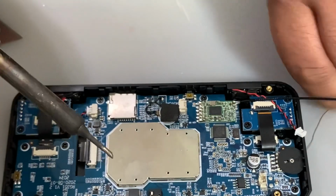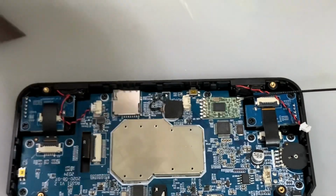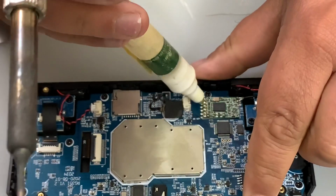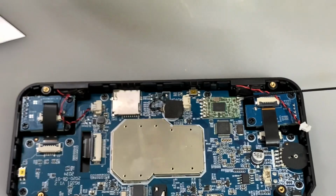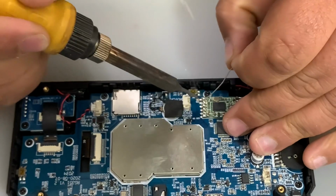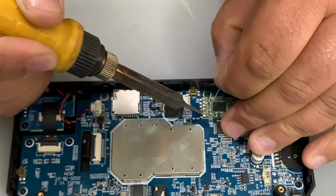So then after, while I've done this, I can grab my solder. I don't know why I've got a tiny piece, because I could have got a bigger one. First I like to flux it up. Okay. Then I grab the solder. And as you can see, all you gotta do is just dab a bit, and you just dab and dab again, and dab and dab.